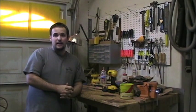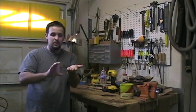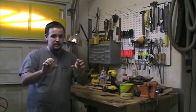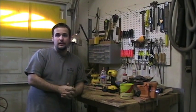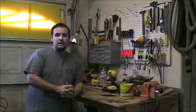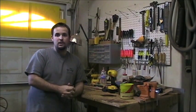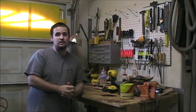I usually use a lot of cam clamps and I'll lay my soundboard out, lay the braces out — whichever ones I'm gluing — and then I'll actually pinch them. What happens when you pinch them is you force the soundboard to take the curvature of the braces, because the braces aren't going to bend — the soundboard is. So it forces it to take the curvature. Clamping and gluing really isn't that much more of an issue as long as you have some cam clamps. I'll show you how easy it is, and you should be able to arch all your braces in the future and get a lot better results.